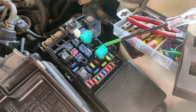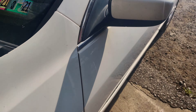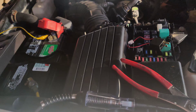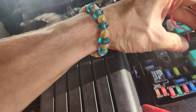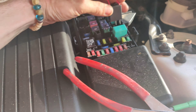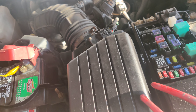I found the relay. So if I turn the AC on now, the test light lights up. The car started overheating — I don't think we have any fan control either. This is a fan circuit and I tried to bypass the relay but we get nothing on the fans. If I put this in here with the car running, our compressor does turn on while the car is running, but it's low on charge — it pulled down to like 20 PSI on the low side and the high side was at like 110. So it's definitely low on charge.